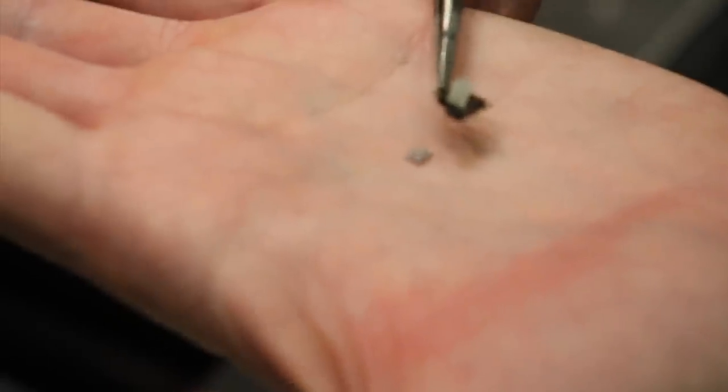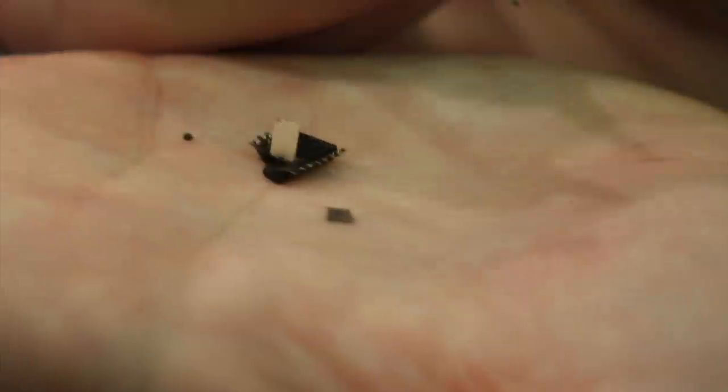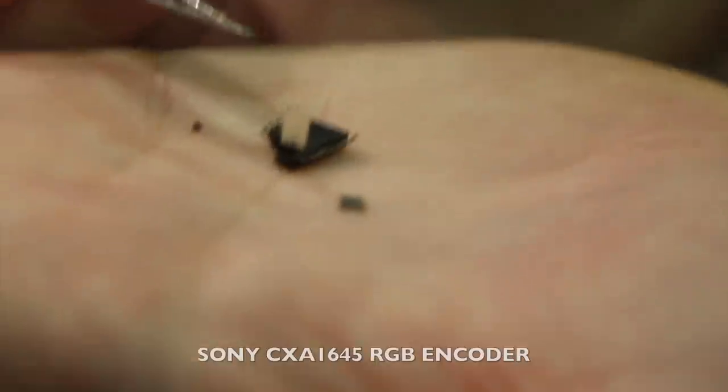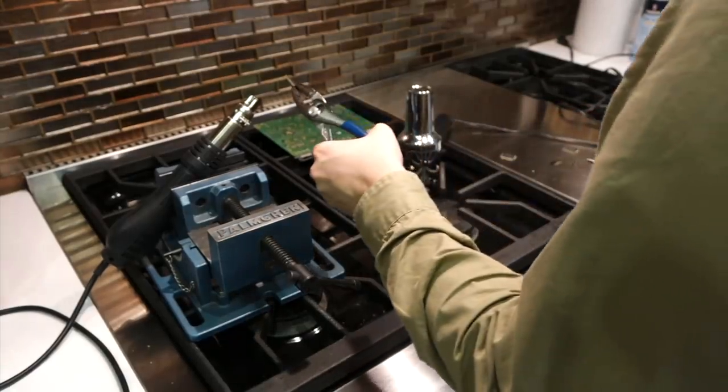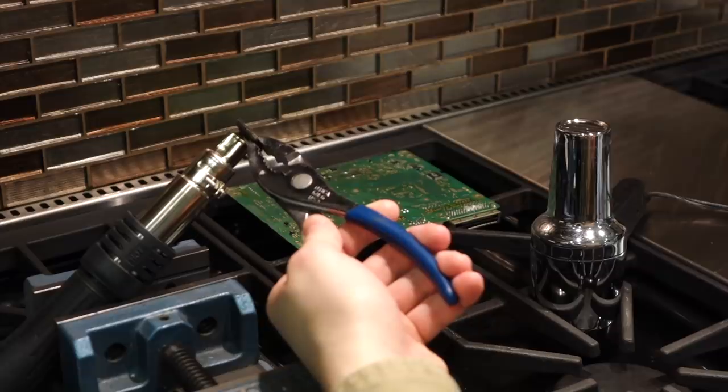It was still attached, bonded to the... It mostly holds by the bonding wire inside the epoxy package. Maintaining the die in the package is a tiny bonding wire. So if you just push it slightly off, you're going to break all the bonding wire inside. I'll try to capture the whole process. You've had success with it.